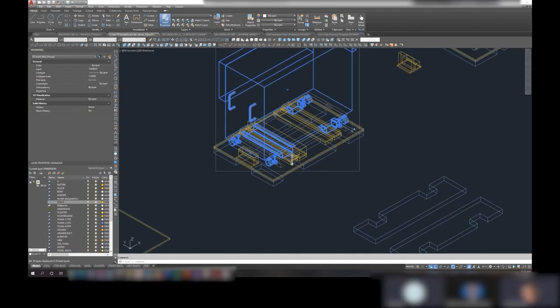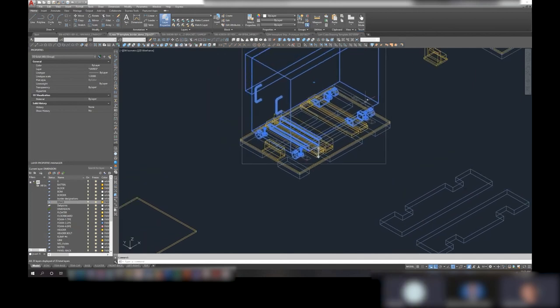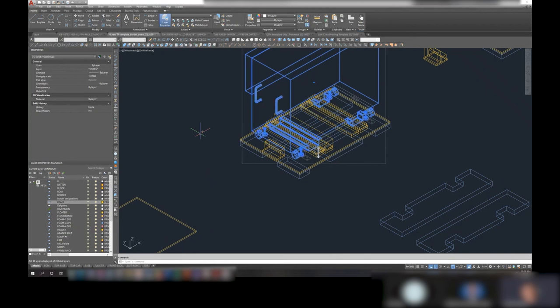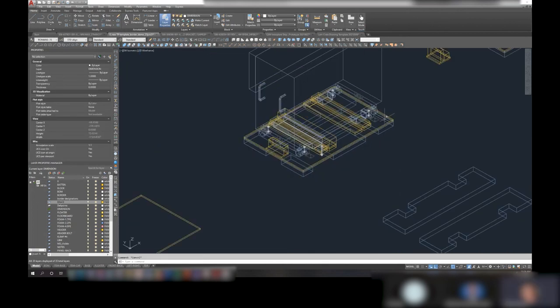To sustain this weight, after the foam that we use for the bottom of the floater, we will need this 2,000. But the 2,500 pounds, normally I will not add in 2,500 pounds directly, because the plywood is also on the floater, the floater is also on the foam, you see, the LBM also sits on the foam. If the machine includes too many blockings, then I will add in the blocking weight also. Okay, I will add in those blocking weights.